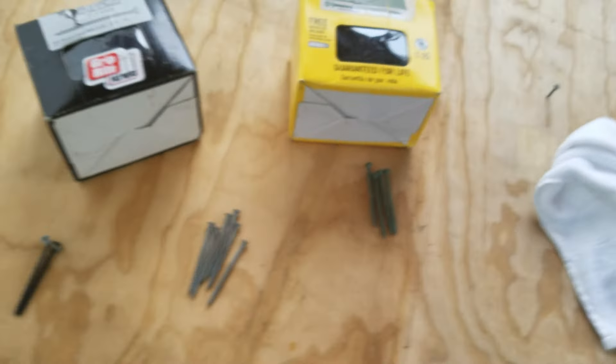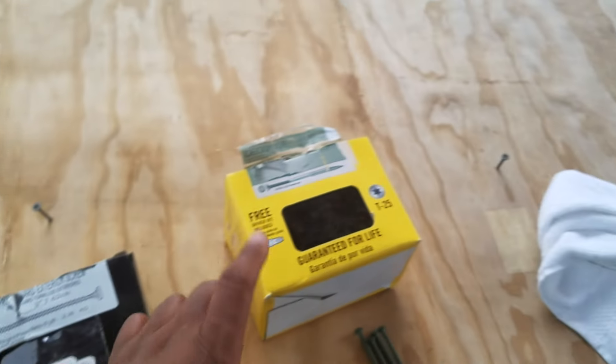I'm only using metal for the framing of the boat. When it comes to putting the skin on the boat, there won't be any metal — I'll do like I did with the dinghy: use screws to hold the plywood in place until the epoxy dries, then put in the fillets and pull the screws out. On the hull, where things could potentially be exposed to saltwater, we'll probably use the Permaguard screws, though I may use the coated lifetime ones — depends on how it goes.